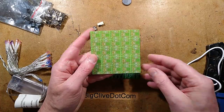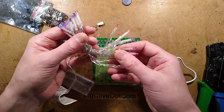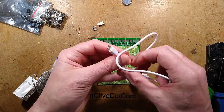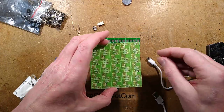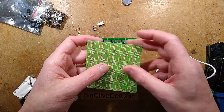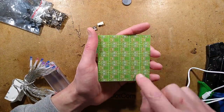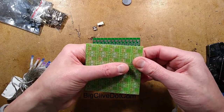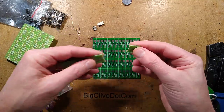This is a 5x5 array of little circuit boards designed as an alternative to previous projects where I've taken strings of battery-operated Christmas lights and shown how you can sleeve and solder resistors in after chopping USB leads off just to use them as a USB connector. I thought it'd be really cool to make a circuit board where you can just plug the USB lead as-is onto the board. It's got the resistors and the connector — just a little interface that lets you connect straight to the lights.